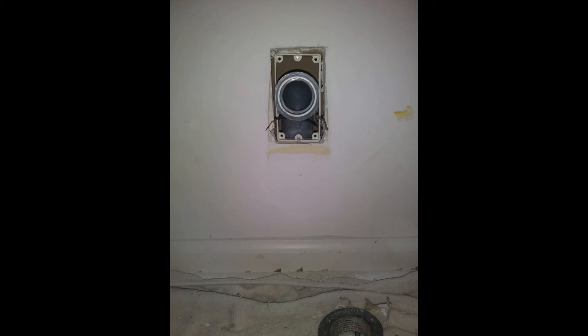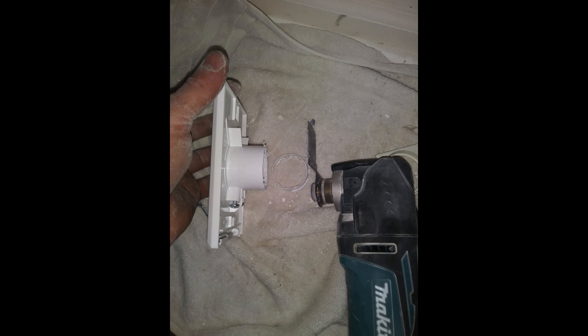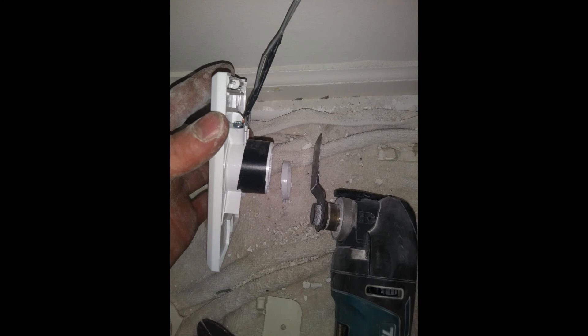Our inlet is going to be a little bit loose — the neck of it into the elbow. I noticed that the inlet when pushed against the wall was actually pushing the elbow inside the wall and was going to cause some stress on the pipe. So I trimmed about a quarter of an inch off the back of the inlet neck with my oscillating tool. And now I've wrapped about two rounds of vinyl electrical tape around the neck — that's to make it a nice snug fit on that O-ring retainer inside the elbow, and that'll be airtight without using any adhesive. I've connected my low voltage wires, one to each terminal — there is no polarity. Nice and easy. And we've installed our inlet with the screws provided.